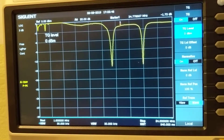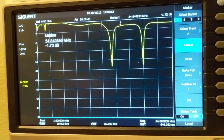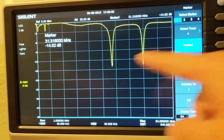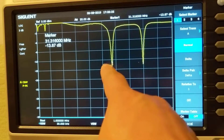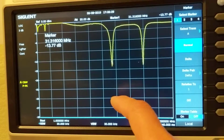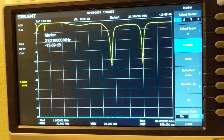Now let's hook up the long wire antenna and look at its response. Around 160 meters, let's first look at these two valleys. One occurs at 31 megahertz and another at 43 megahertz — at both of those frequencies there's not much usable band to transmit on. Even at the deepest valley the reading is only 13 dB down.